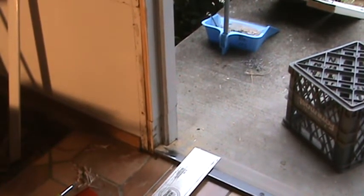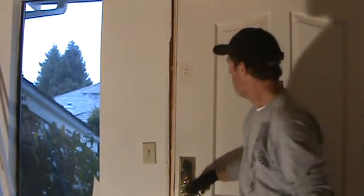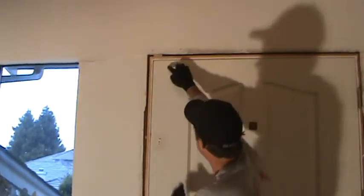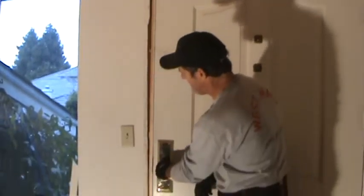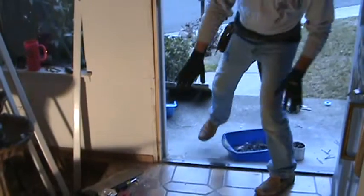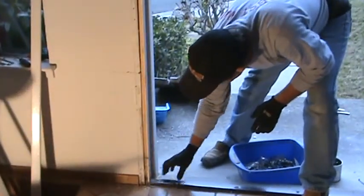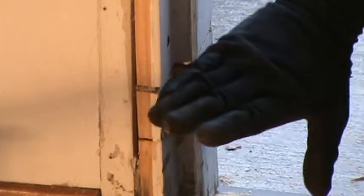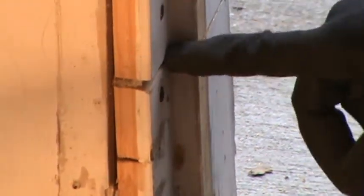Look at this — we've got a nice reveal here now. I pried that down, cut it a half an inch, and now this is exactly where it's supposed to be. The strike plate lines up and the deadbolt goes in. I had to reattach it down here. The reason I did not want to take this off first is it would have been really difficult, and there's an alarm pad right here where they drilled a hole that's still connected. So I cut it right there, wedged this down, reattached it, and I've got just enough here to put some caulking in.